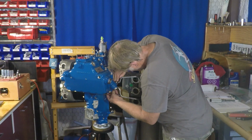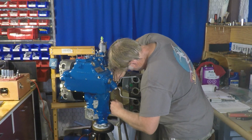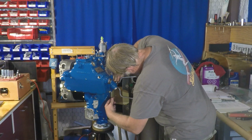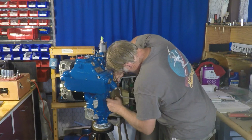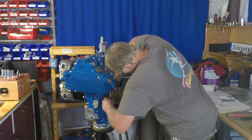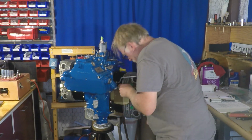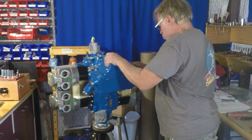The other thing is on this side of the engine, well, maybe on both sides of the engine, this is above the sump, so it's kind of in a little corner. It's above the sump in front of the engine mount, so it's in a little bit of a pocket. They're a little bit difficult to get to. On your six-cylinder engines, they'd be a little easier, but on these, they are a little more difficult to get to. So we're going to try to have some pity on the folks that are going to be operating this engine and keeping an eye out for leaks. On a Lycoming engine, there's no reason why the engine should not run absolutely perfectly leak-free. They're not drippy engines. They're not leaky engines. But if you have cylinder base leaks or drain back tube leaks or even intake tube leaks where they go into the sump, those all need to be addressed. These are very nice engines. There's no reason why they should have any leaks.